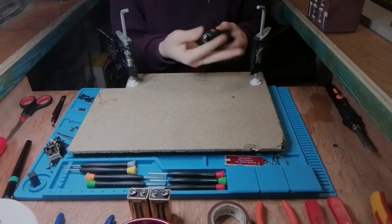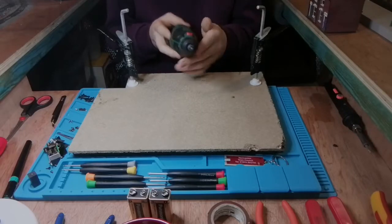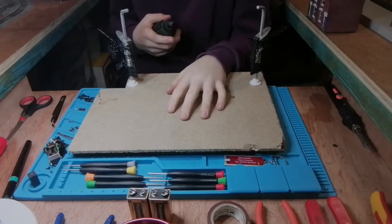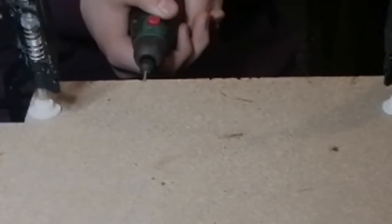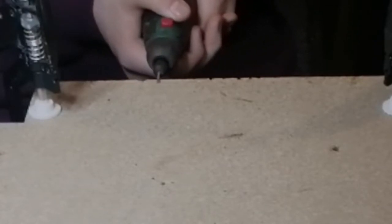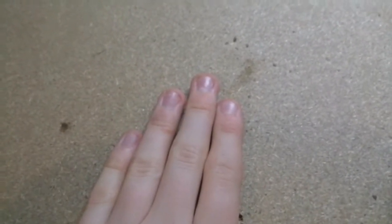Now a quick look at the milling attachments. I have the little spiral router bit installed. I won't do much routing to avoid making a load of wood dust, but just a few basic tests. Set the speed to mid, and we'll see if it can do a plunge cut into this chipboard — not plywood as it's too messy and burns. The plunge cuts around the edges of the board were totally fine. Cutting along the top it did bog down a little bit, and cutting from the edge of dense chipboard wasn't very good.